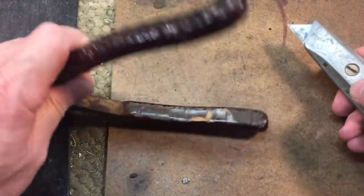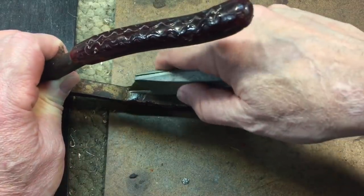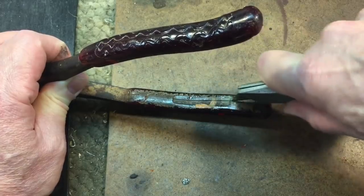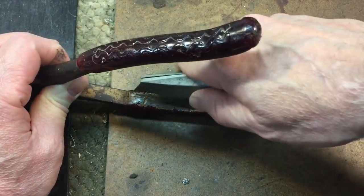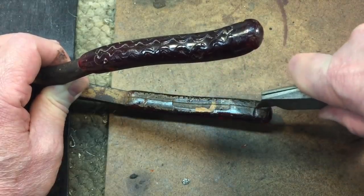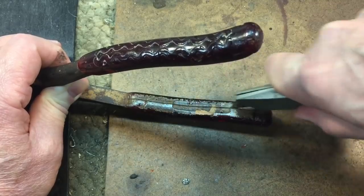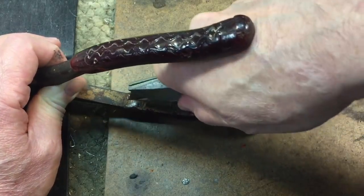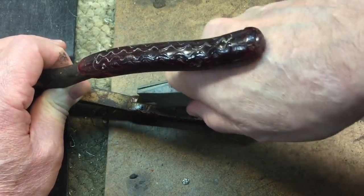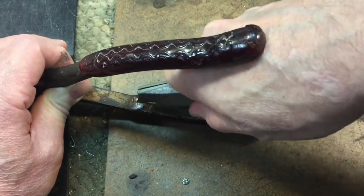To remove the old Klein coats, the first thing you do is take a utility knife and score around the back. You score a light line right down the middle, all the way down. Don't try to do it all in one cut — make multiple passes in the same line, back and forth. Eventually you'll make it down to the metal of the pliers without scoring the metal itself. It might take you 15 passes or so.